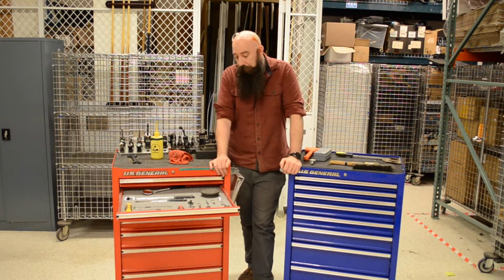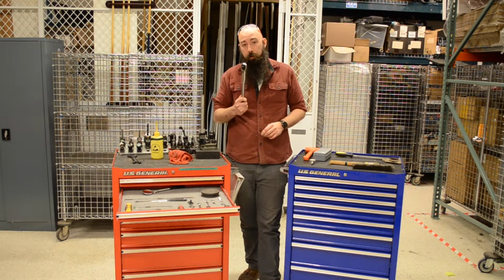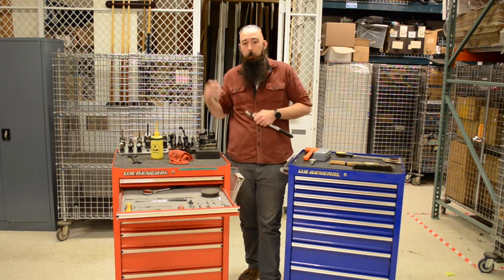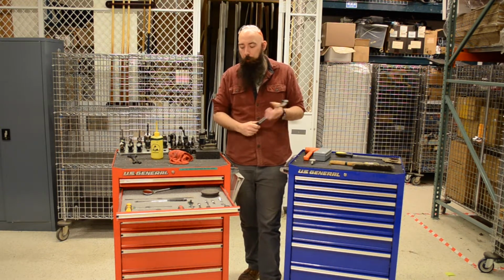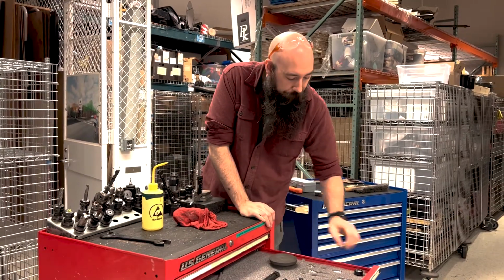That is it mostly for that drawer. On the mill, definitely mandatory so that you can do repeated setups, the exact same torque wrenches. We have foot-pounds, inch-pounds, and that way, if you're always cranking your vise to 20 foot-pounds or whatever, your part isn't going to come out different because you squeeze it a little harder and maybe it flexed and it's coming out a little thinner because you removed some more material. But if you always set it up the exact same, you're more likely to get repeated parts.